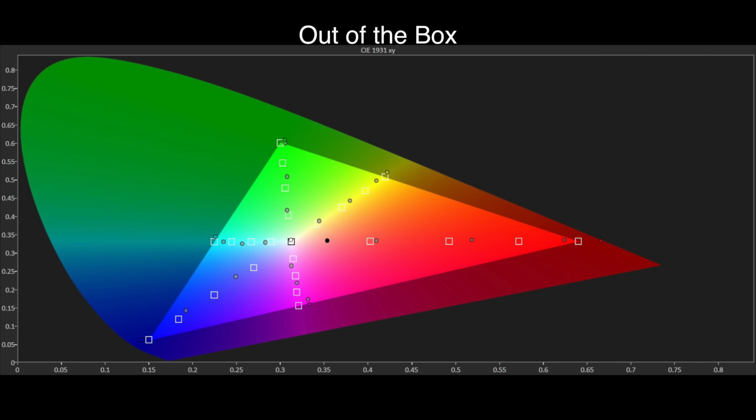Looking at the colour gamut, the projector is limited to Rec 709, which is the triangle in the middle of the graph. It does however have some severe tracking issues with 75% saturation points. These are too bright and end up tracking the same as the 100% points, and this suggests that the BenQ is pushing luminance to make colours look brighter because it can't reach the wide colour gamut of DCI P3 for 4K material. This is a shame, as an accurate Rec 709 gamut and tracking is much more preferable than this attempt at artificially boosting colour luminance performance.